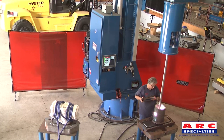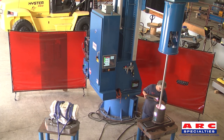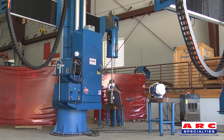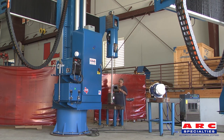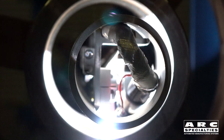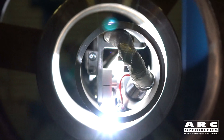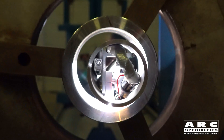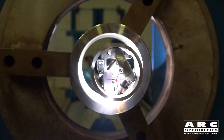As many of you know, we've been building hot wire cladding systems for valves and chokes since the 90s. During those early years, folks were working on how to solve the same problem in pipe. The problem on pipe is you're having to reach up to 40 feet deep into diameters around 5 inch or even less. It was a tough application, so people were trying gas metal arc, they tried extruding pipe, a lot of different applications.